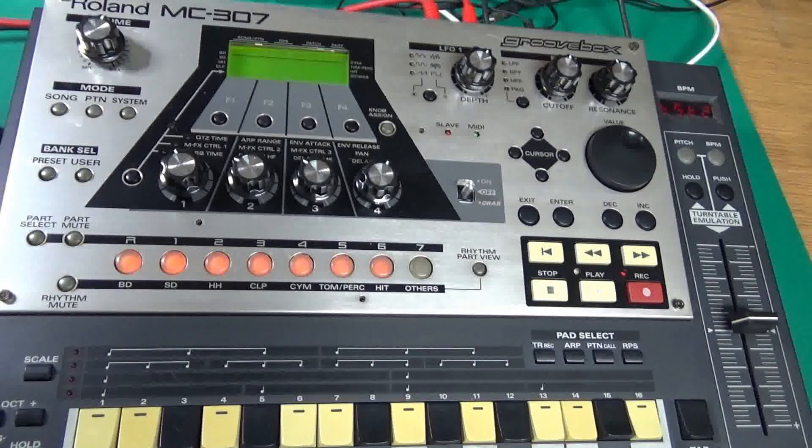If you let it go through this test and then try to turn on the unit, it's going to be the same — a blank screen. After I wipe all of this memory, what I need to do is load the program data and then the song data. I'll have the links in the description from Roland's website. I use Bome Send SX and send everything one at a time.